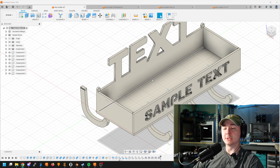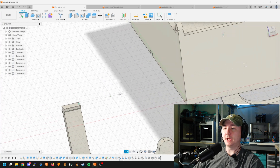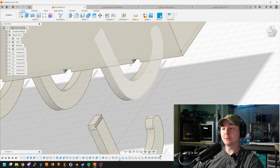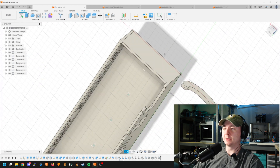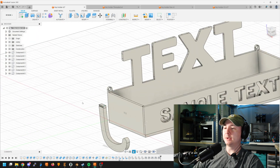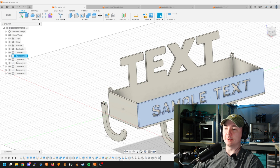When I initially wanted to redo this design, I wanted to design something that had no supports, and that the hooks could be easily replaceable if they broke. So my first idea was to do dovetails on the hooks that would slide into the back, and you would have to glue them in place, but you would have replaceable hooks, and it would print with no supports, because each thing would print in the orientation it was meant to - the hooks would print like this, the back would print like this, and the front was a completely separate piece that would detach.